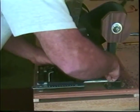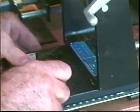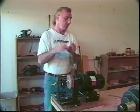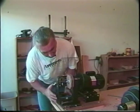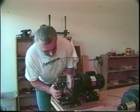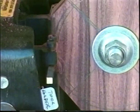So we're going to change this right now, move this to a 90 degree cut, tighten it back up. If you put it in the guide pin's holes, it will not be the right diameter to fit evenly on this. But with the circle we just scribed, we can now see where we need to make that depth of cut. So we just align this up to it, tighten. We don't even need the guide pin — the index pin — for that.